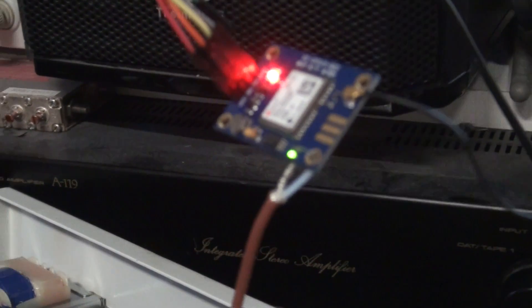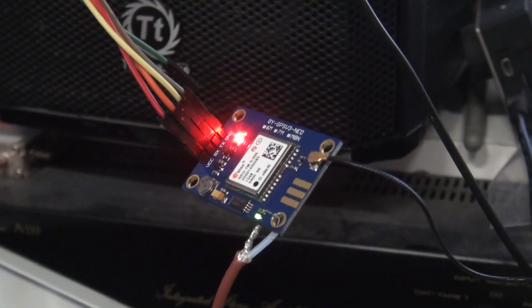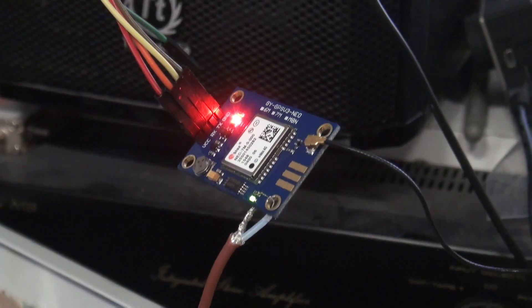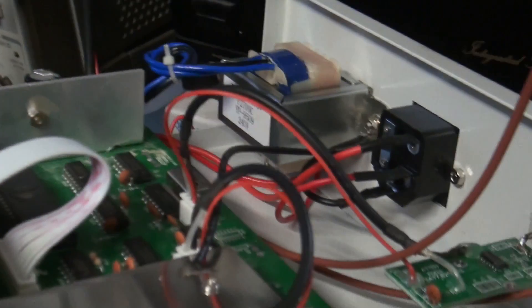This output here you could actually use with your GPS board via a switch on the back if you wanted to have both the GPS board and the actual internal reference connected and be able to switch between the two. The board itself can be programmed to output any frequency you want from 1 Hz to about 15 MHz. In this case I've got it programmed to output 13 MHz, which is what this frequency counter requires to produce a stable reading.